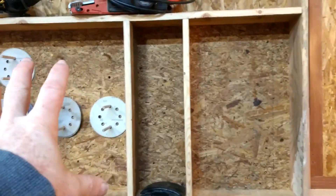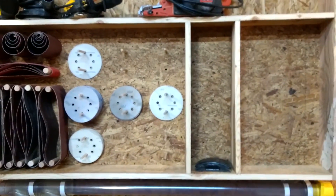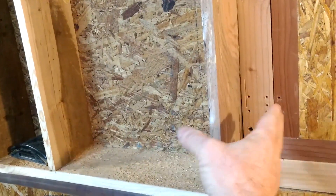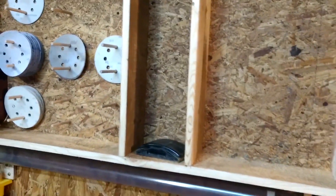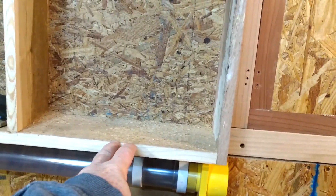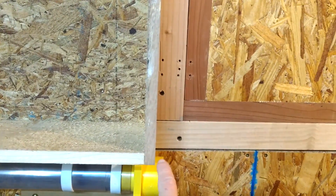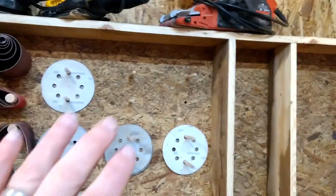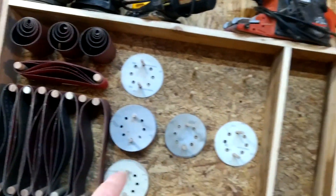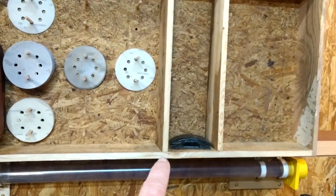So this big OSB board that I showed you before, I just tacked it up there with some brads and then drove a couple wood screws in there, and that is not going anywhere. I've added a little bit of a frame — this is some real piece of crap wood that I salvaged that had a skip plane done on it because it was all water damaged and rotted. I just cut some pieces to length. These frames are not attached to the OSB that's attached to the wall — they're actually pocket-holed directly into the wall, and then they're tacked to each other with brads through the side.